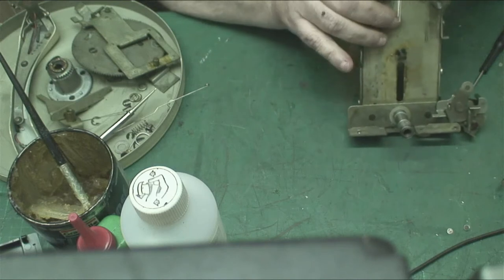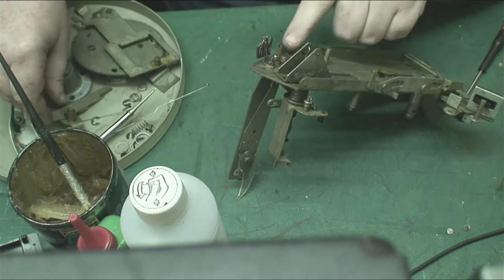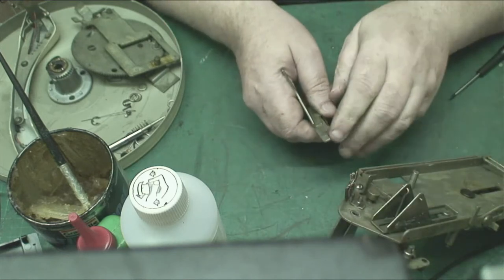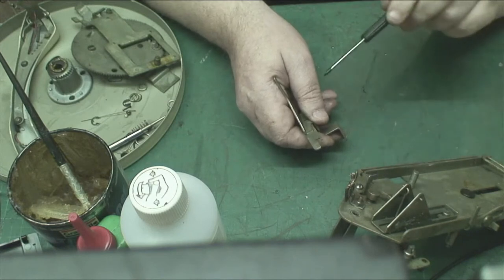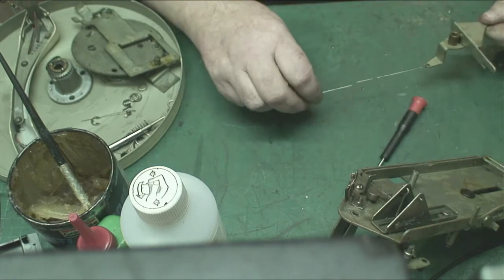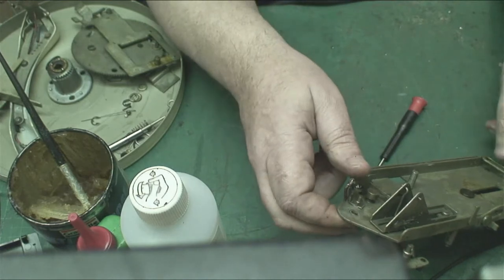usually this is held by this. Let's go to the other camera. Let's move the main mechanism a minute. Let's get a screwdriver. That part there is held by this. And as you move your control arm back, you're slightly pushing this. And that's what causes that to fall off, and causes that to drop, and your tone arm flies out into the middle.